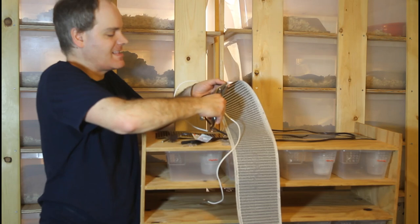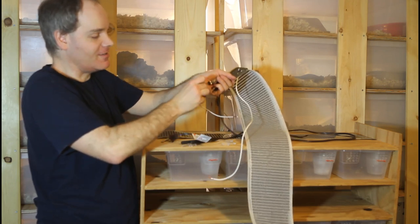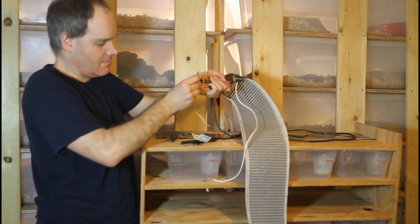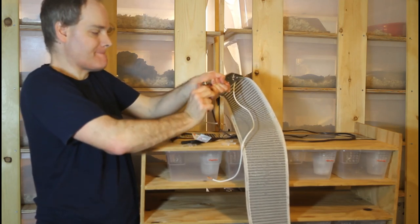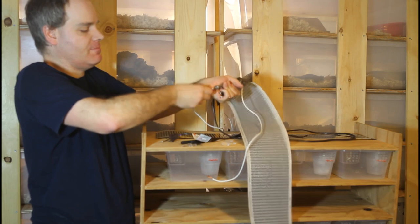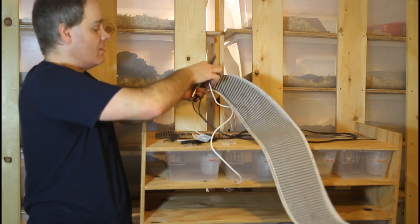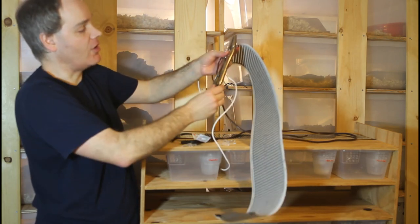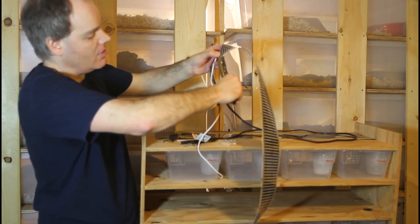Put that on there like that. Squeeze. And then I'm going to tighten it with my friendly little Allen wrench. Which is not being so friendly right now. Okay. Get that in place, nice and tight. And I'll loosen it. And I'll usually do this again one or two more times. I just want to make sure that I'm getting as good of a connection as possible and that these little metal teeth are making contact with the electrical conductor bar.